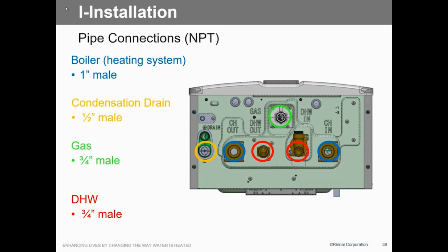Now, here's a big thing about using a brazed plate heat exchanger for the domestic water. Rather than direct firing that fire right on that tube for the domestic water, like you do in the standard Rinnai or Sensei, we're actually superheating that water. So we're running 1,800 degrees that's hitting that water. So we have a trouble with that trying to peel off some of the calcium that's in there and stick to the sidewall. Well, with this, we're using the intermediate.